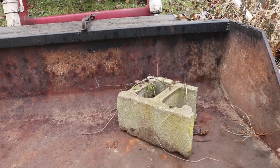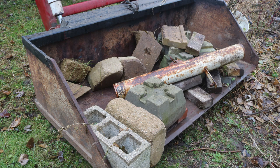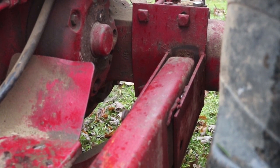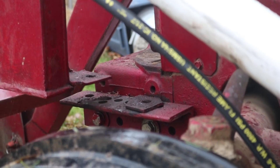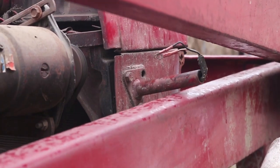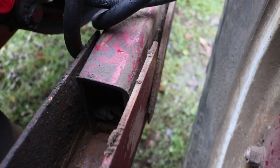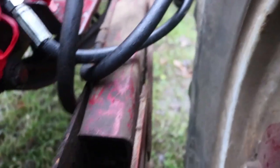I put some ballast in the bucket to help hold down that end while I'd try to release the opposite end of the loader. I'd watched several videos on removing loaders from tractors, but this was an old-school loader — not a quick-release one — and it really looks like it wasn't designed to be easily removed. There were issues in the front with the clearance on the mounting tabs, and also the loader frame wouldn't clear the headlight stalk, so I had to remove those as well. Even when I could scoot the loader frame forward, I ran into issues with that darn spacer that some old farmer had welded on, jamming up the works.